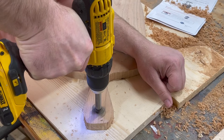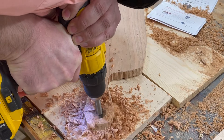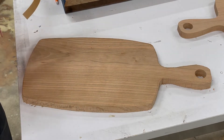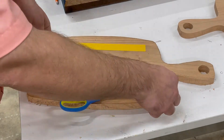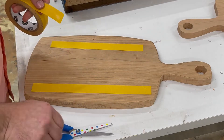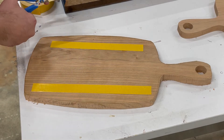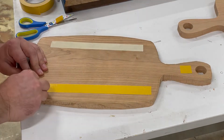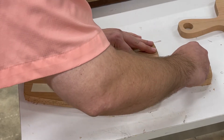Right here I've got a one inch Forstner bit on my drill. I probably should have just left this over on the drill press because you can see it kind of get at an angle there, but I had my chuck off the drill press. Then I've got some double-sided wood tape, cutting that down to put the acrylic template back on there to get ready for the router table, so we can ride that edge and square that up.